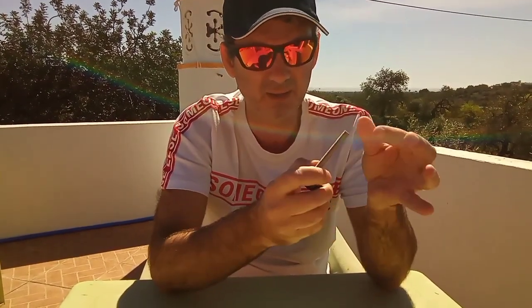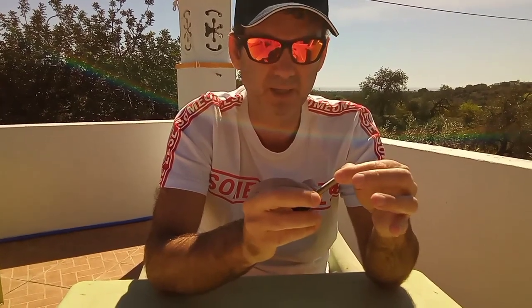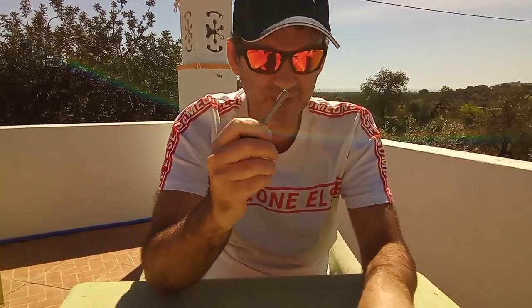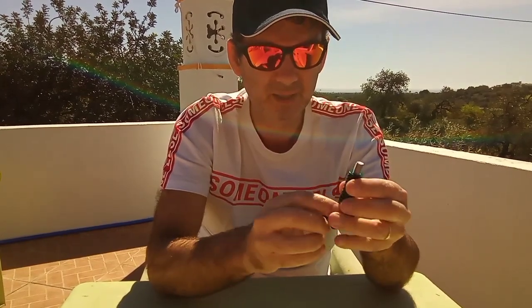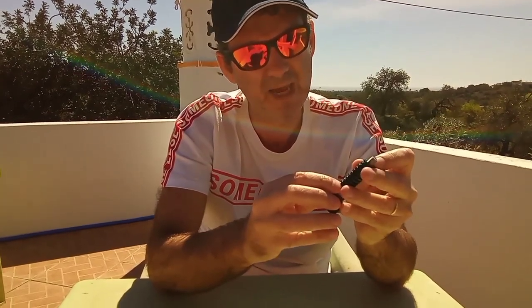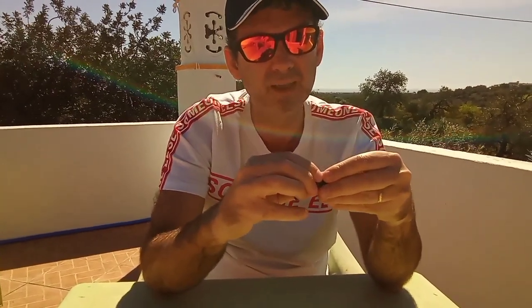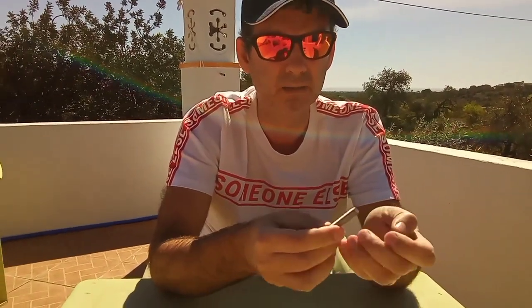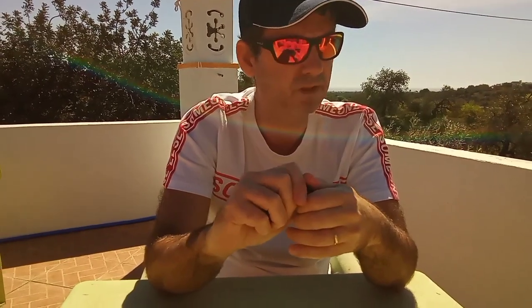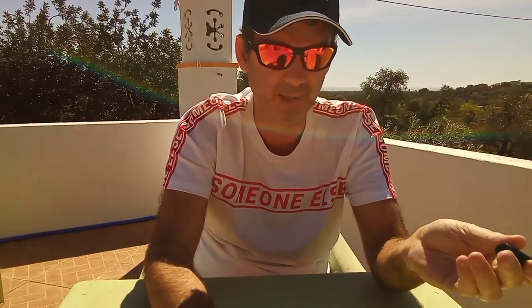So I started thinking, I have this fixed, this is metal with metal fixed, and there will be dilation. If I use the spring, the touching points will be here and here too, but as it has a tension, the dilation will be absorbed by the spring. So I thought, yes, it will be better to try the springs, and I did it.